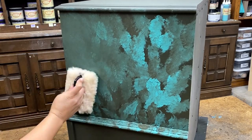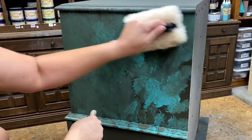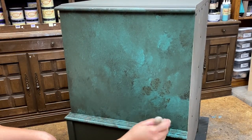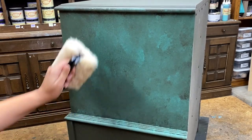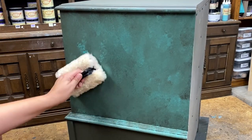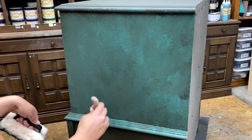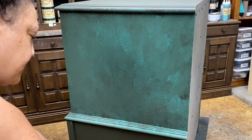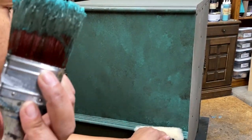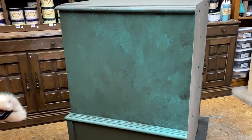Stippling means I am tapping it on, and as I do this I am alternating the colors. Once I had my section completely covered with paint, I gave it a pretty generous misting of water before going in with the woolly, which is a thick-napped faux finish tool. The water helps make my paint pliable because we don't want it to dry too quickly. As I blend using this woolly tool, I am sure to tap rather than drag because I don't want dragged or pulling paint.